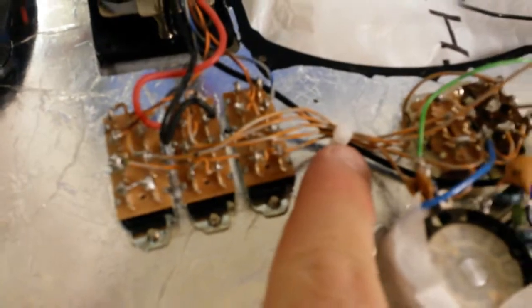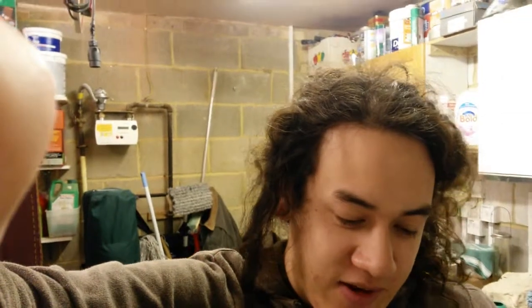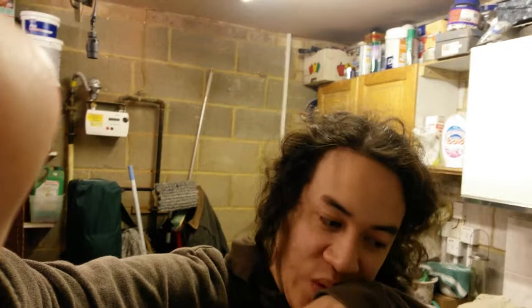And a quick tip: after you've done the electronics, you want to make sure you cable tie stuff so that it fits into those cavities really easily. Otherwise, you'll have a nightmare poking every loose wire. And it did fit into the cavity pretty well last time, so that's nice. So yes, on to shielding a guitar.